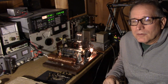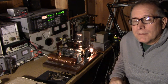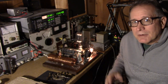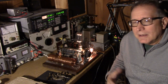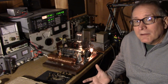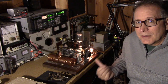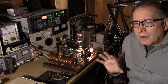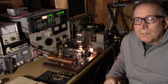These primitive transmitters do drive you nuts and a lot of work is put into them to correct the problems. Like if the thing is drifting up the band you want to figure out what that thermal drift is all about and how to correct it. You can work on chirp, but a regulated power supply is going to clean a lot of stuff up. But is it really appropriate to use on a transmitter like this?